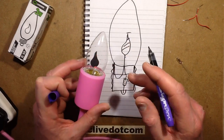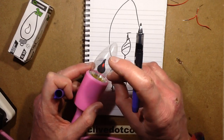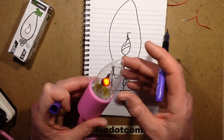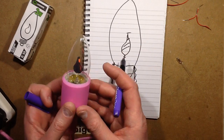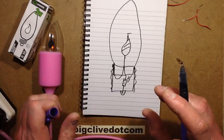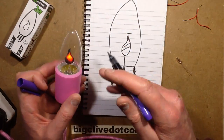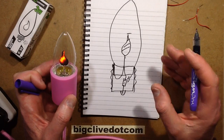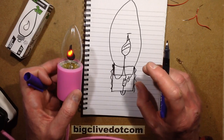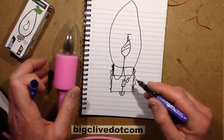This is a very common mode of failure of the British lamps. For a start, we end up with a smaller flame - the American ones tend to have a larger area for the same size resistor. We tend to have smaller flames and the resistors in the base tend to burn out; the bases get very hot. I did a video about that - how you can get the little candelabra type lamps for Christmas arches and actually add another resistor or a little capacitor inside the candle, which will save the lamp life considerably, because it's always the little resistor that seems to burn out.